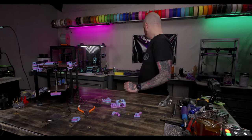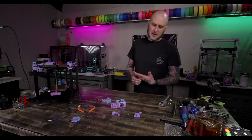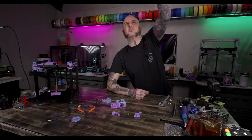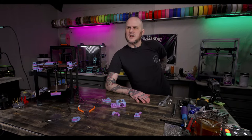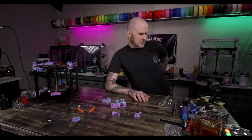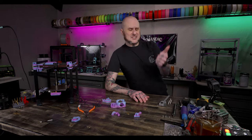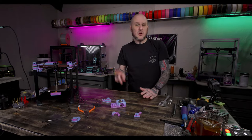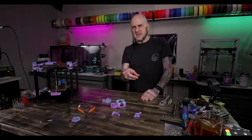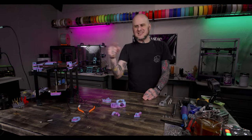I don't know where I put all the hardware for this kit. What electronics am I going to put in? I intended to put in a Pi Zero 2W, but I've switched up. I'm going to be using an SKR Pico, a BigTreeTech SKR Pico, which comes with the kit, and then a Pi 4. Reason being, I want to put a touchscreen on this. I want the Waveshare 2.8-inch touchscreen, and you need the DSI connection for that.